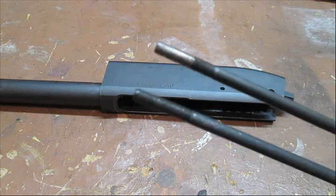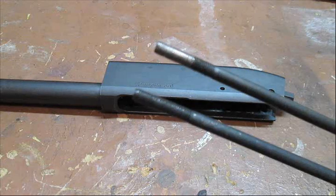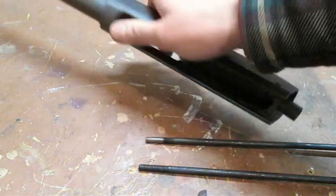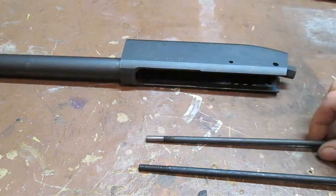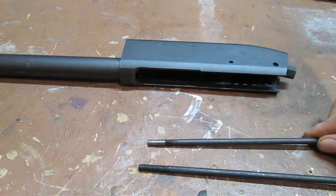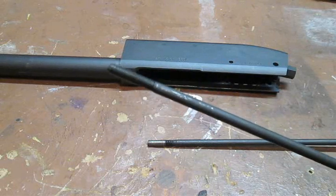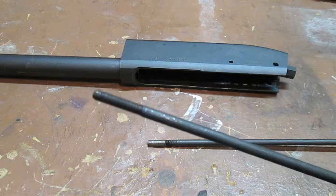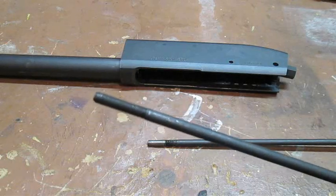For comparison, this stock bolt is the same part but with intact threads. The threads in the original receiver stud have matching damage, which is why the original stock bolt can still be screwed in and will hold the stock on securely enough for normal use. However, other stocks or grips that require different bolts cannot be installed on the shotgun using this stud, since it effectively has a different thread now.